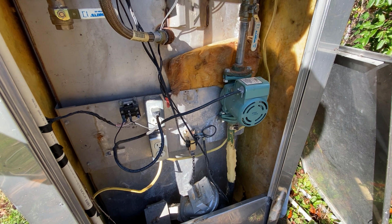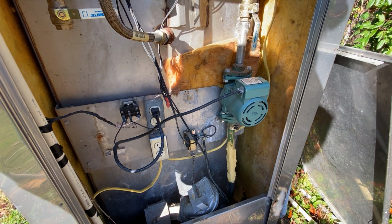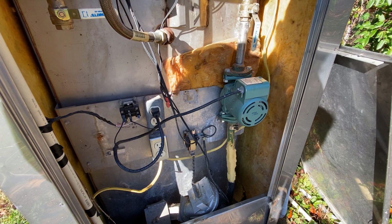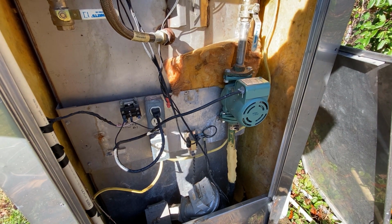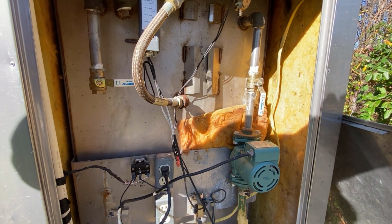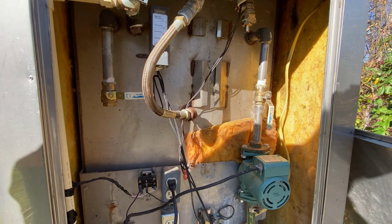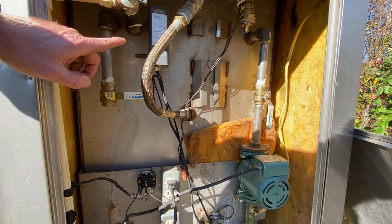And that way you're not just running the fire all the time. Otherwise your water would boil and it would boil off. So if you're having trouble with these particular Hardy units, the Aqua Stat is something I've had to replace before. It's a pretty simple fix to replace that Aqua Stat there. But mine was boiling off, and that was part of my problem.